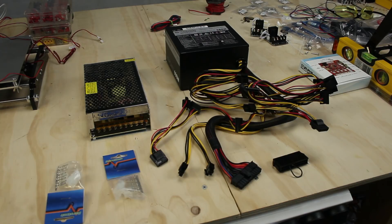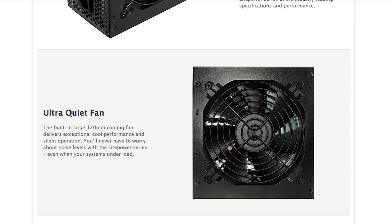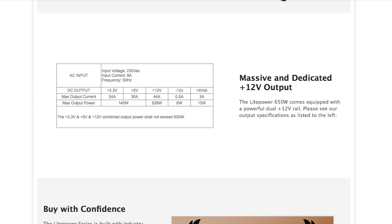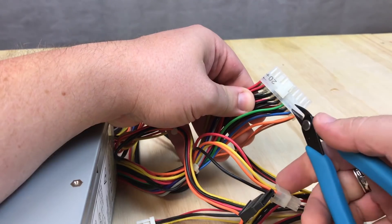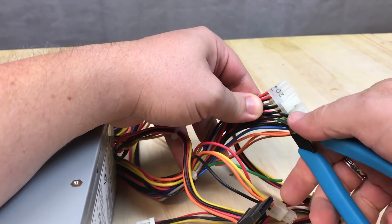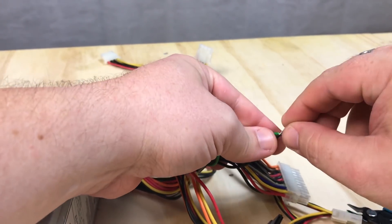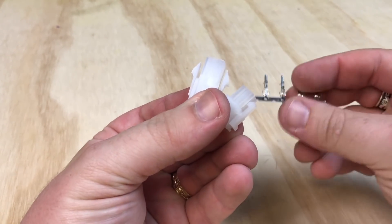Next I'm replacing the stock power supply unit with the Thermaltake ATX power supply. I've chosen to go down this route as the ATX power supply has its own power switch, all the wiring is connected, tested and safely terminated from the factory. It's cooled by its own 120mm fan so it can deal with longer prints and higher ambient temperatures. The 12V power rail comfortably provides over 30 amps. It also has the additional capability for hooking up other fans, lights, and other mods. In the spirit of good cable management and neatness, I'll be connecting the power supply to the printer using Molex connectors.